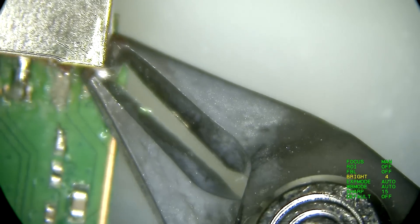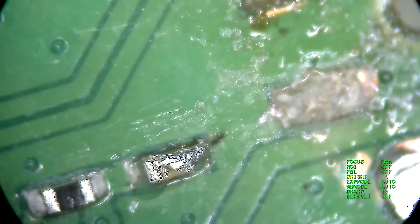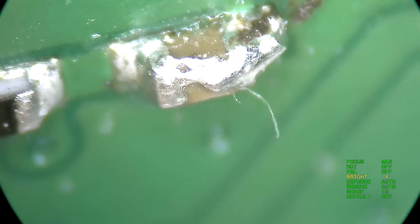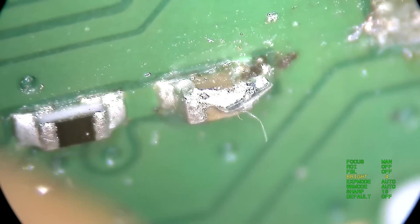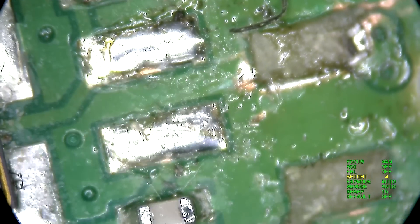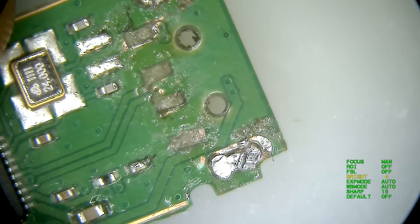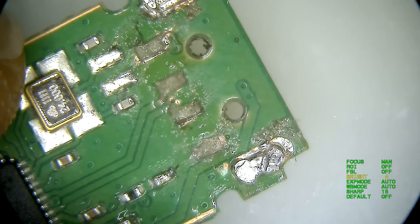Basically it's the exact same case — every pad is just missing, it's not there. I'm gonna cut this. But this is the kind of stuff I would be worried about: this capacitor is basically shorted, so whatever the function of that capacitor was, it is no longer the same. Let's try to fix this — I think it still has life in it.